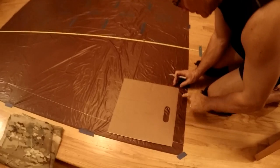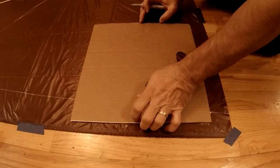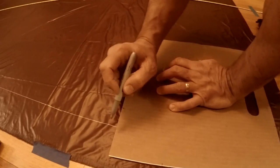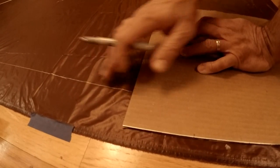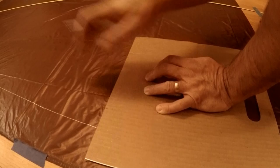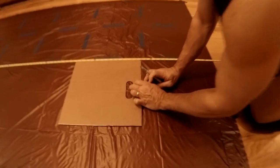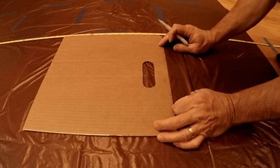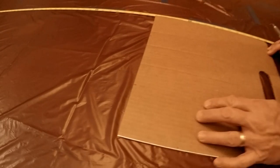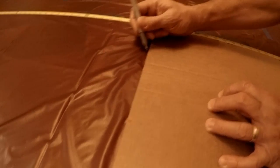Now, pick the thing up, move. Simply line this back up, line across the bottom, with the reference points on the side that I've already marked. Okay, and then I mark the top. Now on the top here, because this is going from, you know, 50 inches to 40 inches, that's an angle. These baffles on the side, I'm gonna mark them 6 inches, but I'm gonna make this 5, 4, 3, 2, and that'll be the last baffle, because there's a point of diminishing returns for that. Okay, simply move this up, line the dots up again. Okay, line the dots up over here that I've already made, and take my little Sharpie. I'll make two little dots, one there, one there. So I think by now you probably get the idea.